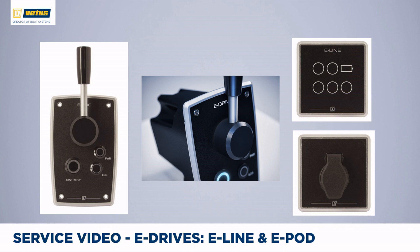Both the e-line and the e-pod are controlled by the same panels. To the left is the control panel for power — a normal lever going forward, neutral, or in reverse. You can start and stop the system with the buttons, and there is a power and eco setting. The power setting gives additional power when maneuvering, while the eco setting ensures a fun day out without worrying about battery range. On the top right is the basic monitoring panel, which gives battery information — full, halfway, or close to empty — and tells you if the system is powered up and if you are in gear.